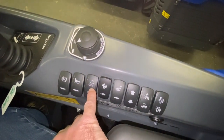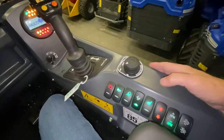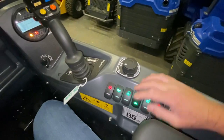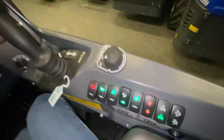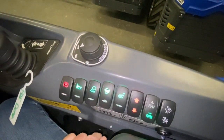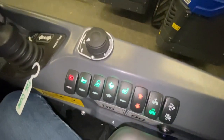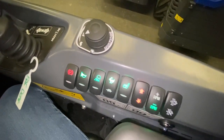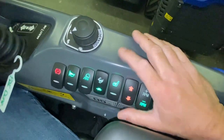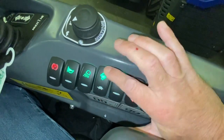You've got a horn, work lights, and high and low drive speed — again you'll get a corresponding light on your dashboard. In low drive you'll get torque; in high drive you'll get speed. You don't get torque if you're in high drive, so you will have situations where you think you've got no power — maybe going up steep ramps onto a trailer and it doesn't seem to want to go. That's because you've got it in high drive. You get all your pushing force in low, all your speed in high, but you don't get both in either position.